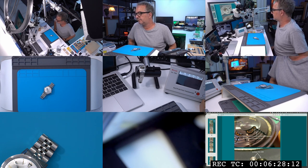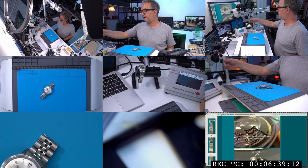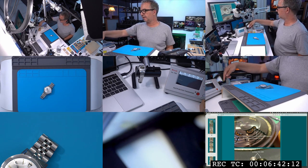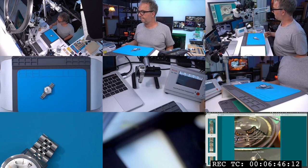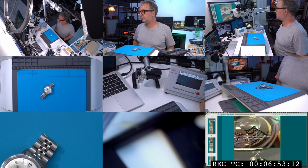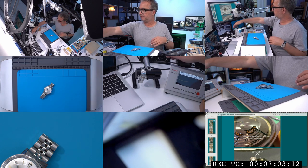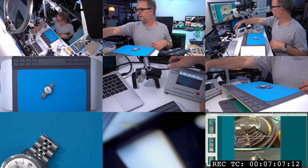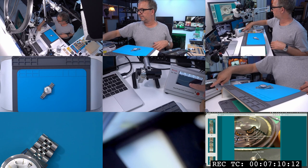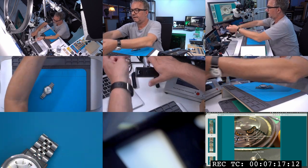In this position, the good movement says it's 13 seconds per day slow, amplitude 234, beat error 1.2. It's not perfect, but it's running and measuring at 18,000 beats per hour, which is what the 2472 is. In the other position it was running a little slow, now a little fast — basically trending toward zero seconds per day. That's how this one should be running, and it's not.